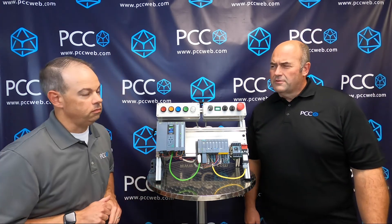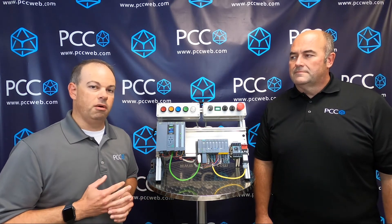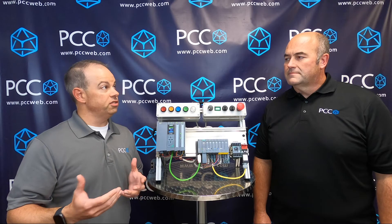That's really cool. So how do you configure that? Siemens has a free tool called the Multi-Field Bus Configuration Tool, which is a free download. You can very simply set the IP addresses, set the device name, set up the I/O, and that software tool will also allow you to export the relevant files for import into the PLC engineering system that you're using.